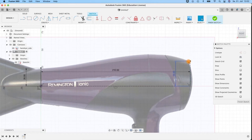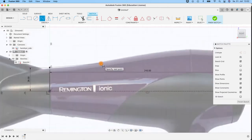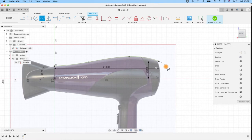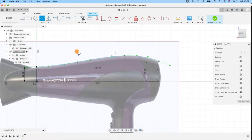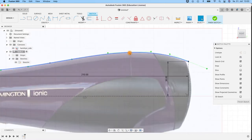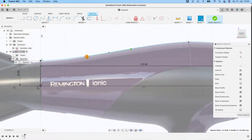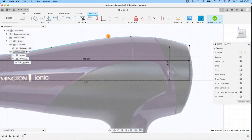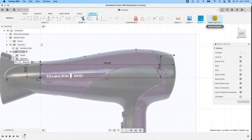This area I'll create with a surface; the handle I'll create with freeform afterwards, so you get a little bit of different techniques. I'll use a fit point spline, snapping it here to this position. Use as few points as possible — just two in between — then connecting to the endpoint. When you need to modify the curve flow with the tensions, please do so.